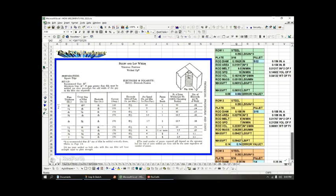But this is basically just talking about welding vertically. So remember, this would be a flush joint, right? It's not a half lap flush, like we saw before. So you always have to make sure, are you talking about an inner fillet weld, an external half lap joint? And always double check the numbers. Don't just take anything in a table for granted.